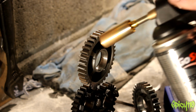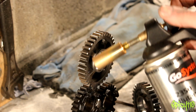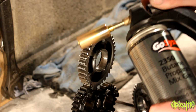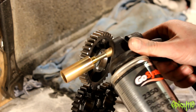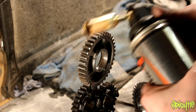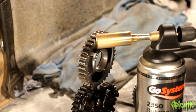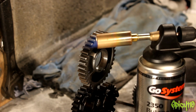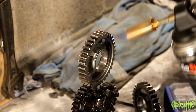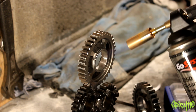Okay, these cheap gas torches, here's a tip that I've learned. You buy them, you use them once, and then it just stops working. And you hear that story from people all the time. So if you listen, nothing's happening. The way you solve this problem is you close the valve, you release the pressure, put the pressure back on, and turn on. Every time. Every single time it works. Epoxy resin gets soft with heat, so I'm heating this up to get it to let go.